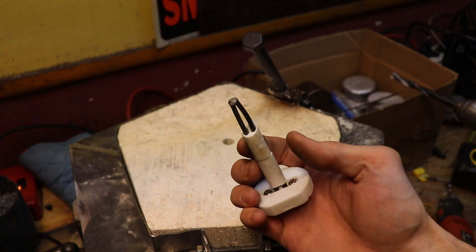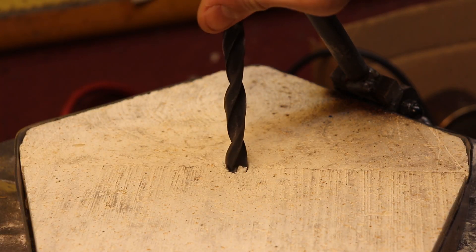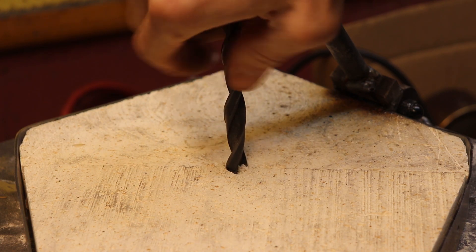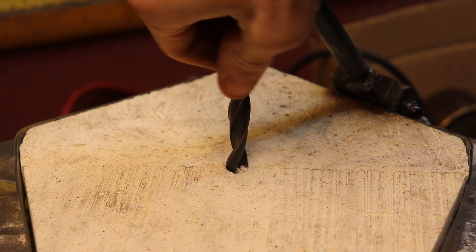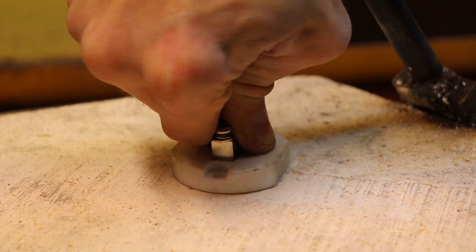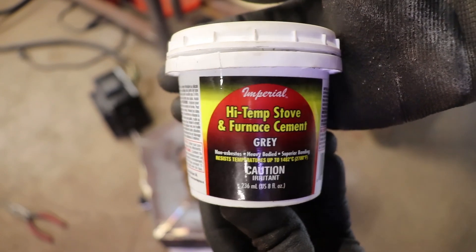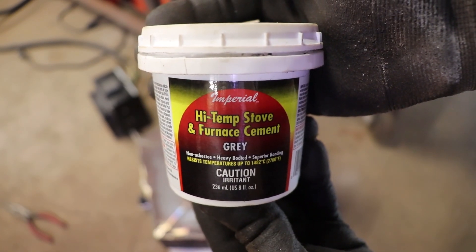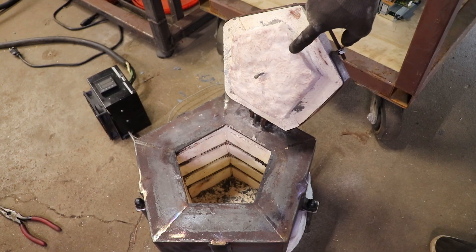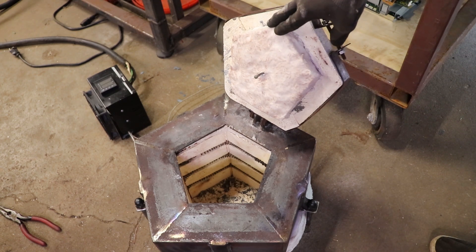I needed a long thermocouple installed on the top of the furnace. To drill a hole, I just took the drill bit in my hand and slowly started to rotate it into the brick — if I used a drill here I would risk cracking the entire brick. It's much better to go slow into this brittle material. Once the thermocouple fit through nicely, I decided a high temperature cement was the best for fixing it in place. I also used the same cement to stick some ceramic fiber under the cover to better insulate from heat escaping.